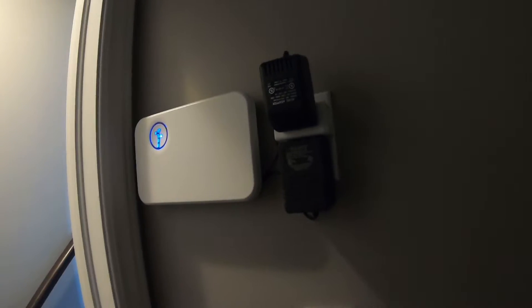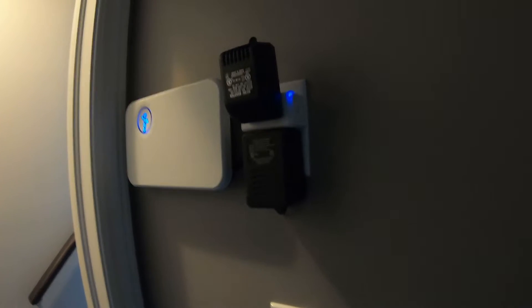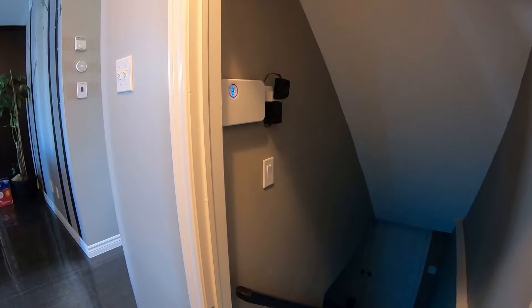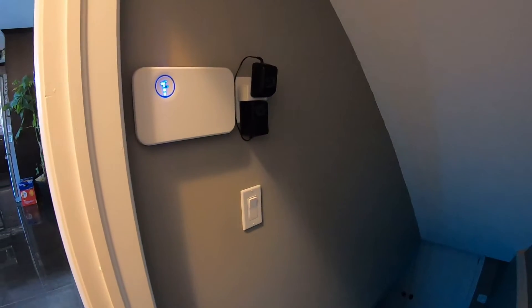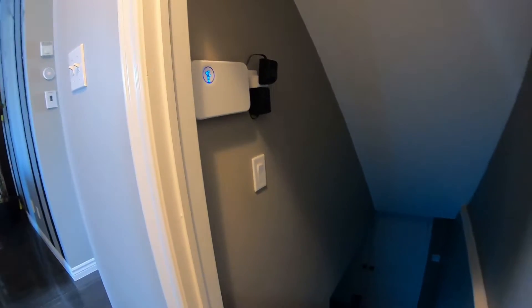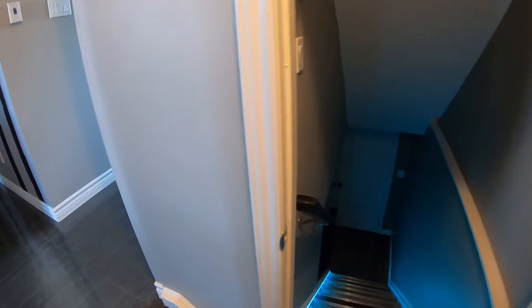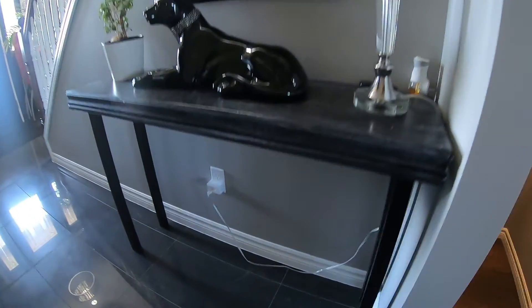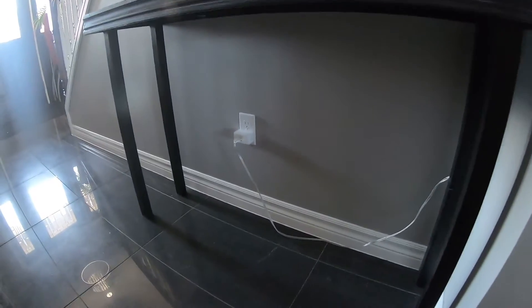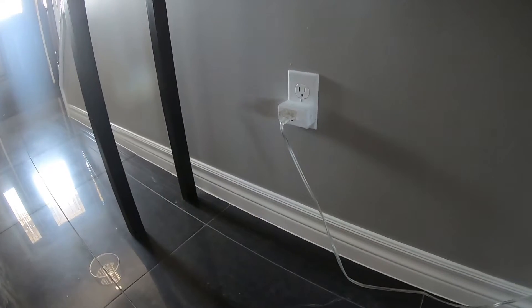Getting a smart-enabled kit would also give you the option to change color easily, like what's offered with the Philips Hue strip light. The second option I had for getting power close by was to run the low-voltage wire straight through the wall to the open side of the hallway, maybe have the wire come through just above the trim where I have another receptacle for a lamp very close. Where and how to run the low-voltage wire will be very important for a clean install.